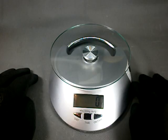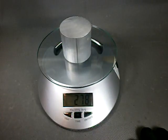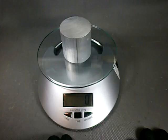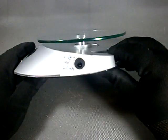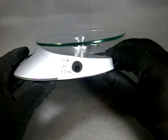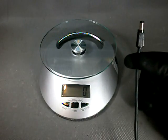So here we have our scale completely reassembled. I re-glued the feet back with contact cement. The scale is working perfectly, as you will see. I will measure this weight, and now what the key designated as on-tare used to do is going to be performed by the key designated as time. I zero it and I have my tare weight. And if I want to reset the scale I press it again and it will work fine. I also installed a power jack, which I have not captured on video but it is a very simple job.